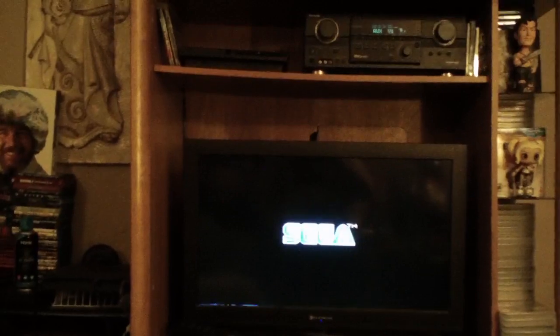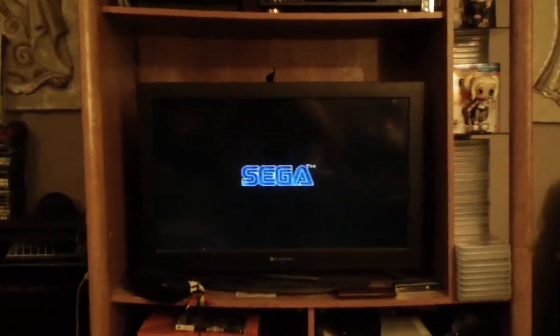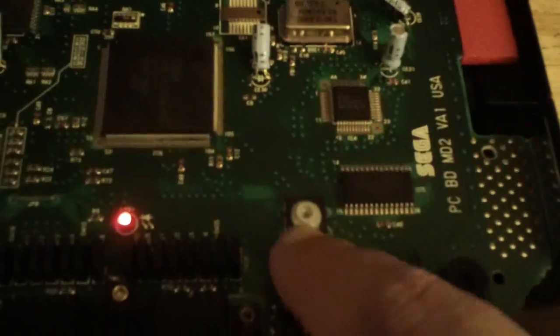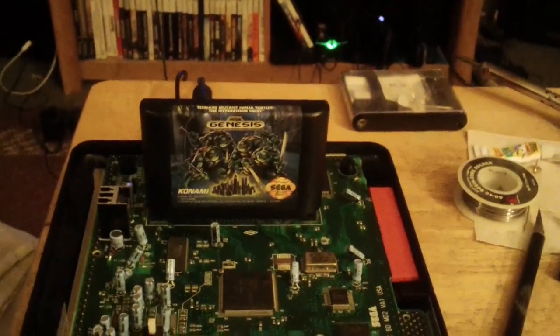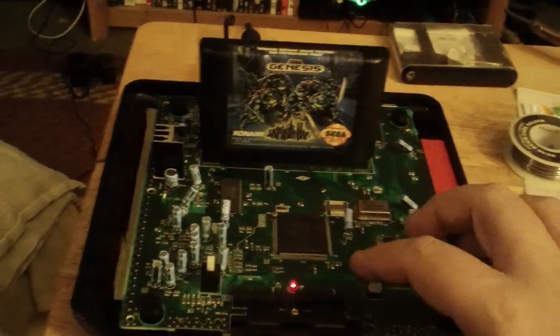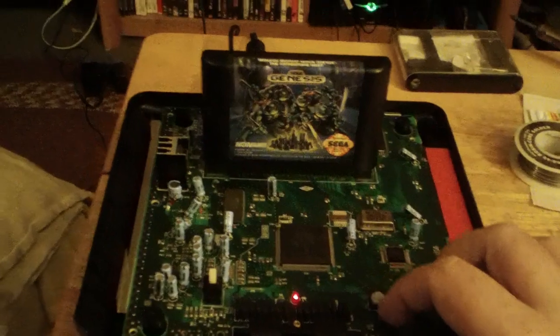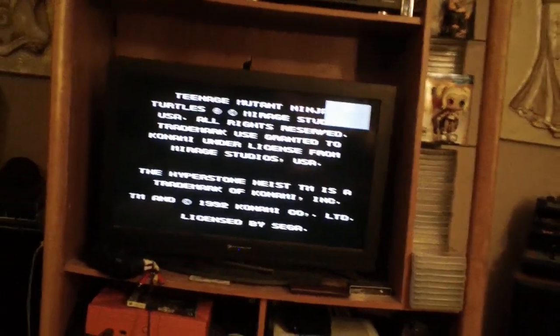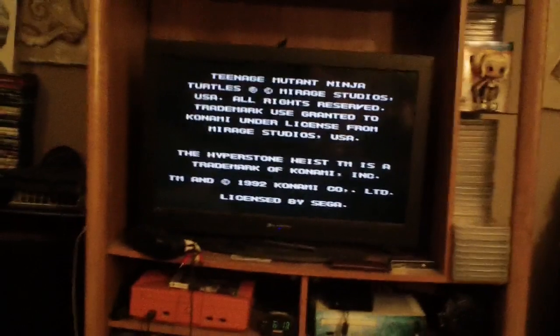I don't know if I can fix it, actually, because I don't know if it just got hit so many times it's just worn out or what. This is the reset thing right here, and there's four solder points on it, but even if I pulled it loose off the one where it's not really working, it wouldn't matter, because I don't have one to put on there to replace it. But yeah, this one seems to be running fine now that I resoldered the part where you plug the power